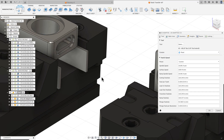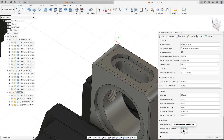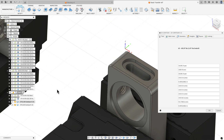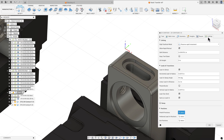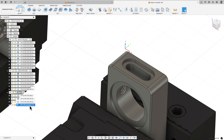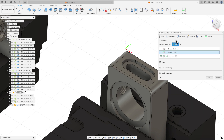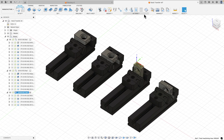I'll take my adaptive toolpath, throw away the geometry, reselect the new face, and specify a pre-drill position since I've already slotted out that radius - I'll grab that arc and hit OK. I'll edit my contour, throw away the chain, select the new chain to machine. On the linking tab I'll reset my linear lead-in to system default and specify the entry position. Then I'll edit the chamfer edge break toolpath, add my two chains, grab the edges I want, and hit OK. That takes care of my third setup.